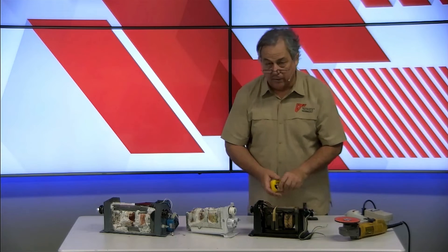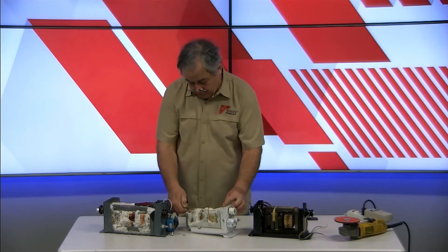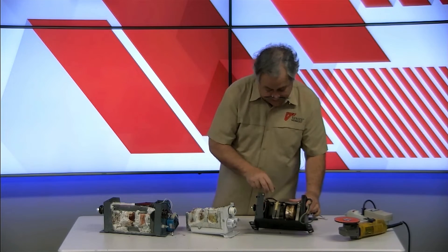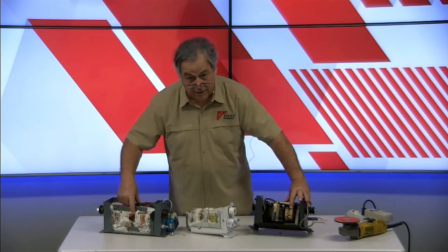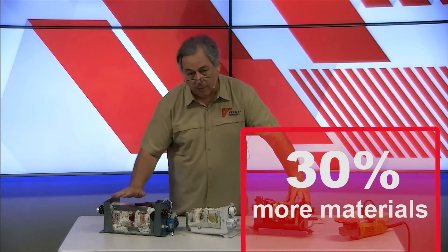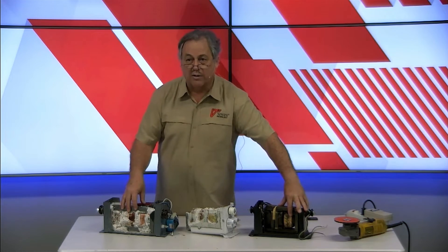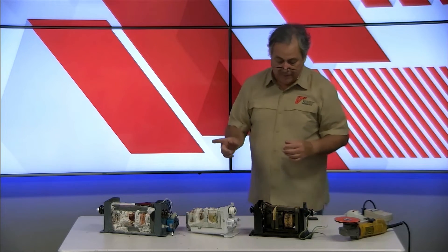If you look at the outside dimensions on this one, it's about six inches long. Here on the Ventex we're at about seven inches — a little more than that. You can see the size of the primaries here versus here versus here — much, much bigger here. We're looking at 30% more materials inside this thing, which means the materials are doing less work to make the same amount of power. They're under less stress, and that's one of the things we think makes this work so well.